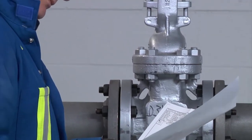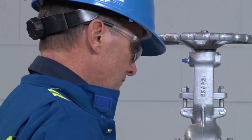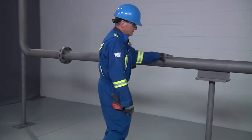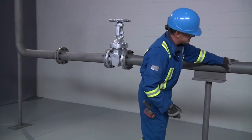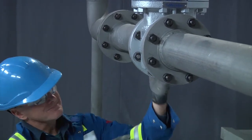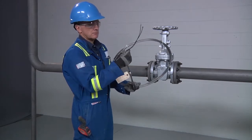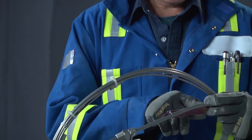Third, make sure all mechanical pipe testing, such as hydrostatic testing and purging, is completed. Fourth, inspect the piping for any burrs, rough surfaces, or sharp edges, and remove them if necessary. Fifth, verify that any surface coatings are dry to the touch. Sixth, inspect the cable coil for any nicks and cuts. Seventh, ensure that you have the correct heating cable.